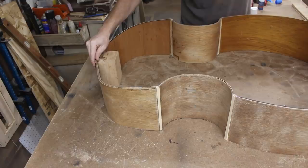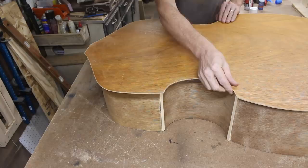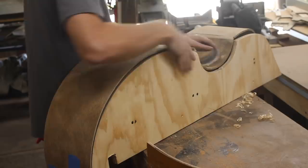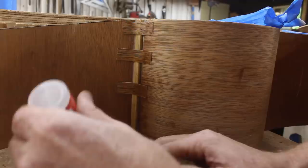Obviously the more pieces we get adhered to each other in opposite directions, the stronger it will get. But before that I spent a lot of time making sure everything was going to line up. Once all the different glues had cured I went and cleaned up the edges and kind of liked the look — at first I thought I'd just cover them with veneer but I decided I liked it. However, they weren't quite strong enough, so I went in with some CA glue and scraps of veneer and made these little patches like a little hinge almost, which made me feel confident everything was going to stay together.